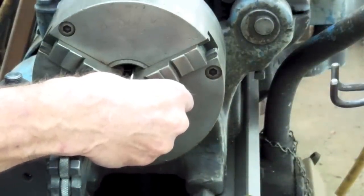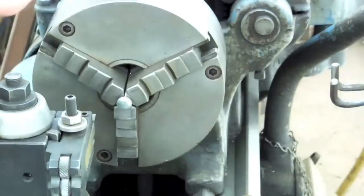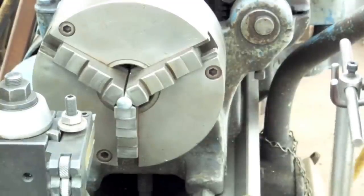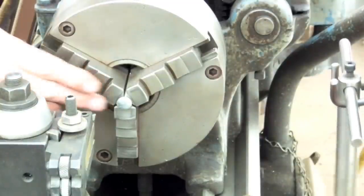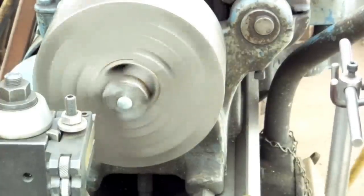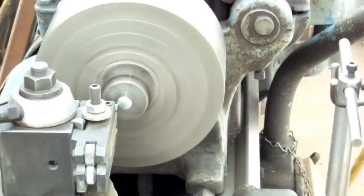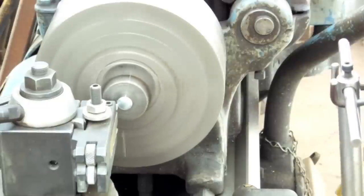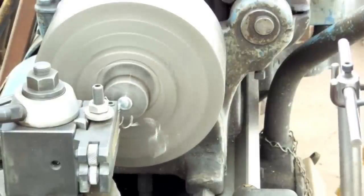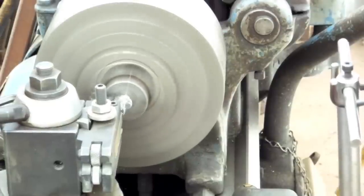And it's just a standard quarter inch carriage bolt. There's nothing special about it. If you don't have a lathe, you can do this with a belt sander or a grinder. It's a little harder to get the bolt head flat, but let me show you how we do it. We're going to feed it slow. Just take the top of it off.